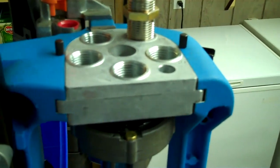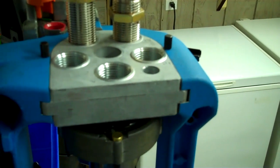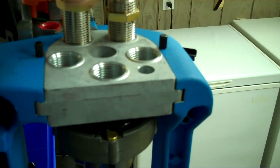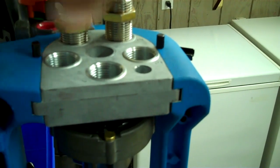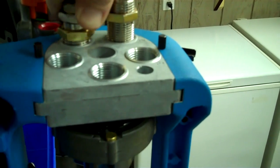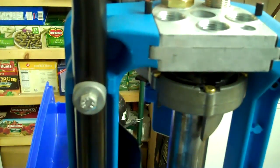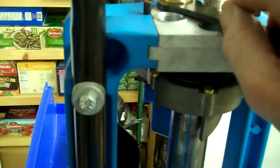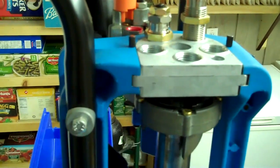You raise your platform all the way up and put your die in. Really simple on pistol — you just run it all the way down until it actually hits the platform. Then you just raise it up about the thickness of a dime, maybe a half a turn, and it's pretty much set. Then bring a case onto the shell plate, resize it, leave the handle down with it in the case, and tighten this guy up. That should be all you have to do for that station.